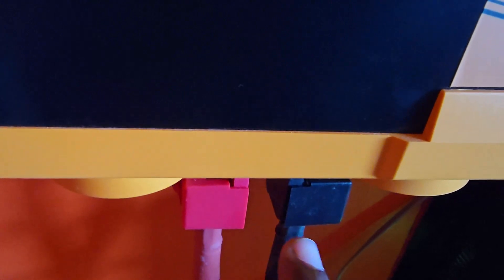Next, check all of your terminal connections. Make sure they're tight, there's no corrosion, and everything is nice and snug. Check your battery terminals as well — make sure they're tight. You can remove them and reconnect them, as a loose fitting could be causing the error or the beep. If you try all of these steps, in most cases you'll be able to deal with the issue. You can also check the manual for error codes and the conditions that trigger the beeping.